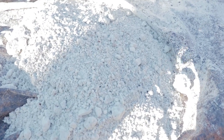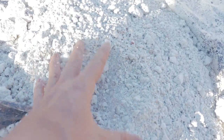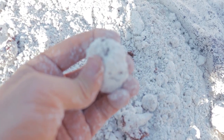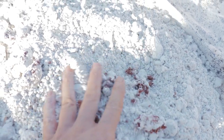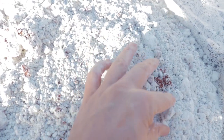Here's the third mix with the pozzolan and lime. You'll notice how white it is — it always kind of cakes up when you dry mix it, but when you add the water it'll take the color of the soil again. All these little globs inside are just the dirt, so your cob is not going to come out white. Once you add the water it'll return to the earth color.